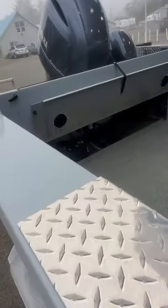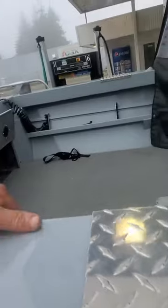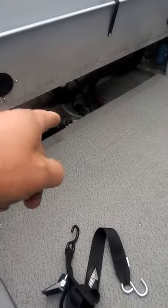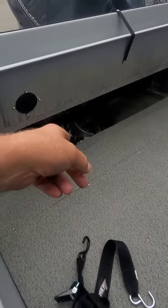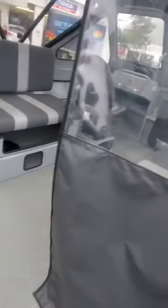Adjusted the height up. Your keys are in there, you've got your boots in the storage box. These are the smooth ride seats — I really like these. This has a single battery with switch. You've got the Yamaha 10-micron filter right there — change that once a year and stick with Yamaha, don't go aftermarket. Heavier paper element down in there. You'll see that hose — there's a seacock valve with that white clear hose. Say you sprung a leak in your wash-down or up in the live well, you can shut the water off so it doesn't fill up your boat.